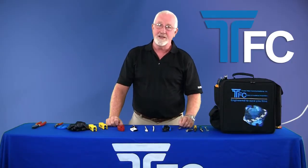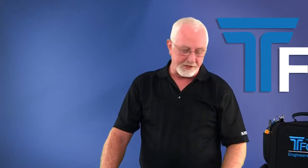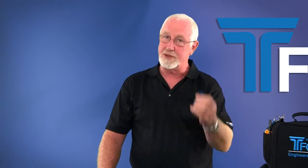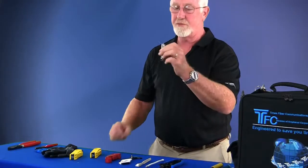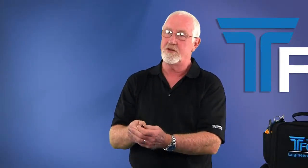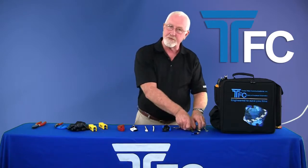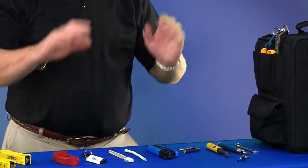That's the easy part. Now, what do you do when you go to tighten it up? There's always been a big discussion on tightening up a connector, and there are a variety of tools out there. Standard 7/16 inch wrench that everybody has used for years carries in their tool pouch. A lot of people prefer the little aluminum ones to reach into tight spots. I prefer one of these, the security sleeve tool with one end smaller for getting into tight spots and tightening things up. Next tools up, torque wrenches. Use the one that is proper for the connector and what your company recommends to get the proper tightening of the connector when you put it on.